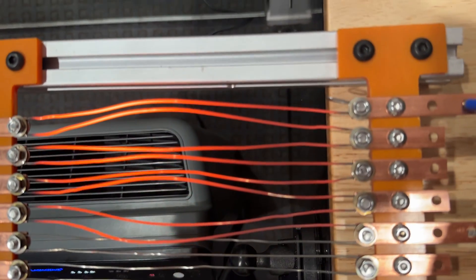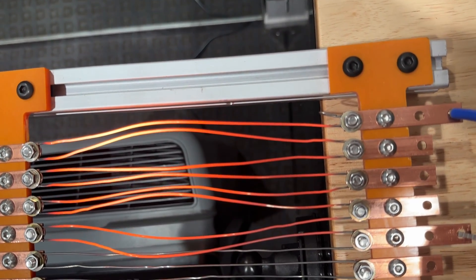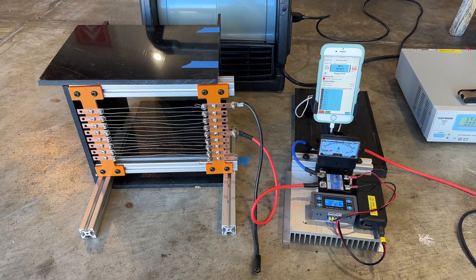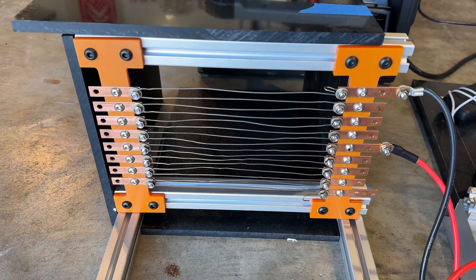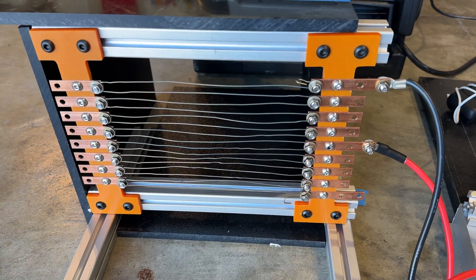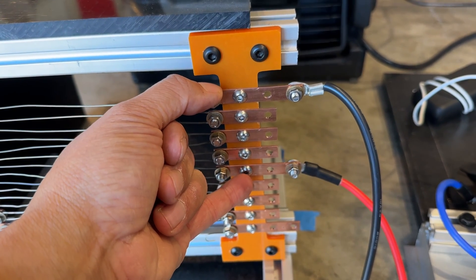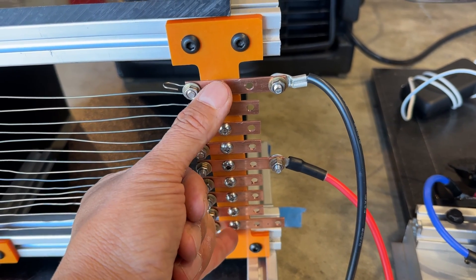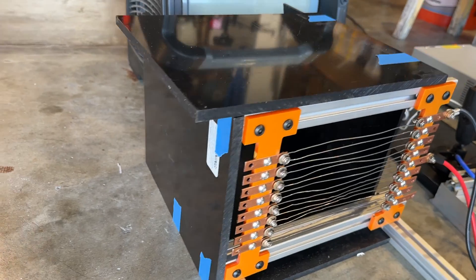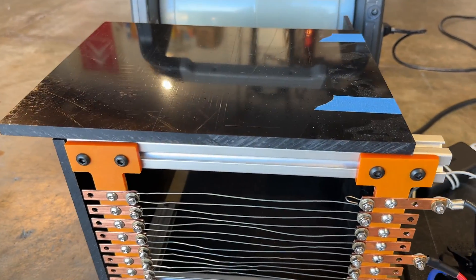This is 48 volts into 2 ohms, so about 24 amps. If I were to do this again, I'd obviously increase the pitch between the wires. I have the resistor mounted in a frame on the floor with a fan shroud around it and a giant blower behind for cooling. Here I'm just using the top half of the resistor, so 2 ohms. The second half is also 2 ohms, so if I want to double or halve the current, I can. I also have the option of changing resistance by 0.25 ohms by using all the different taps.